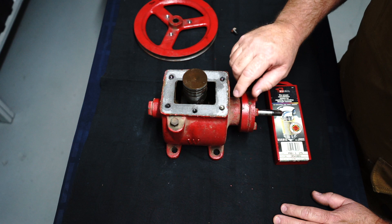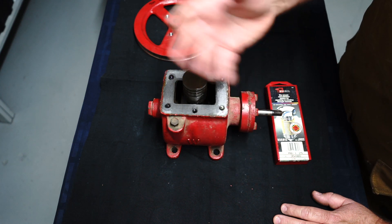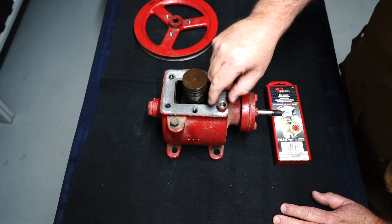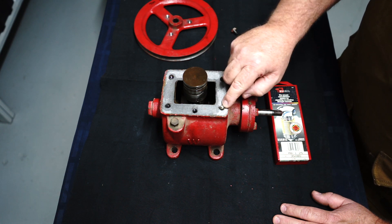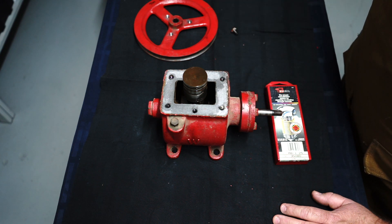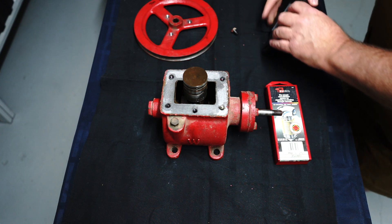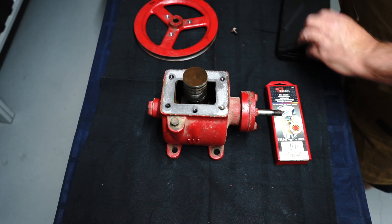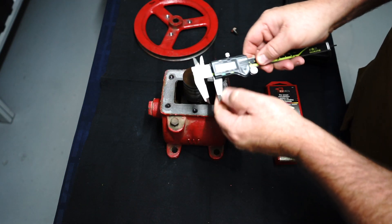In this video today I'm going to show you an old trick that was taught to me when I was an apprentice many years ago, where we can actually just put on a nut, MIG weld that, and extract it. Now I've got a little bit of the broken bolt sticking out — I could probably put vice grips on that and have a crack at it, but I don't think I'll have any luck. When I went fishing down inside here, all these holes are actually blind holes, not through holes, and they're roughly about 15 millimetres deep.